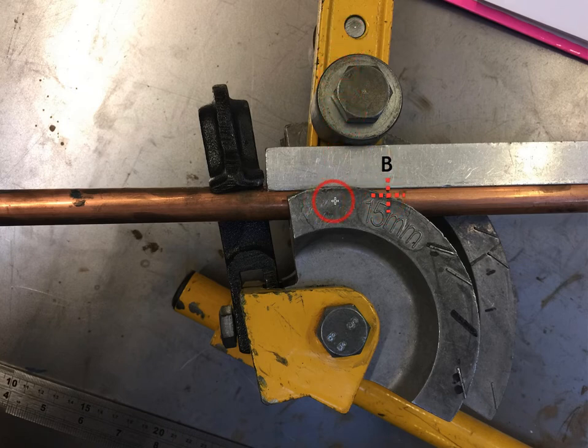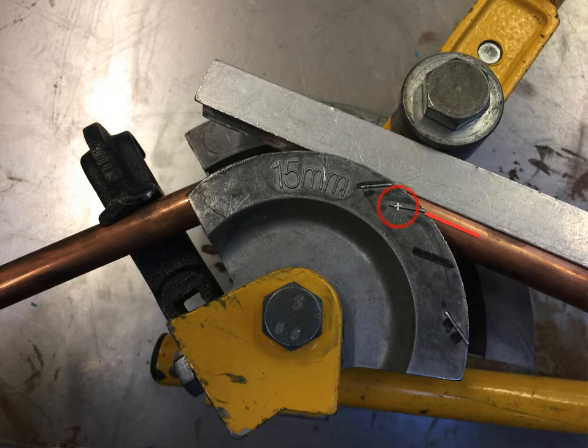The former's in college and there are people out there who may have formers that move. Make sure the former is pushed tight to one side because if it moves when you move the arm, that could make a difference of 5mm or even 10mm. So you need to keep that square. Pull the bend to 45 degrees — there's the 45 degree line. I've placed the line there in red so you can see it in the centre of the pipe. No further, no less — bang on the 45 degree line.